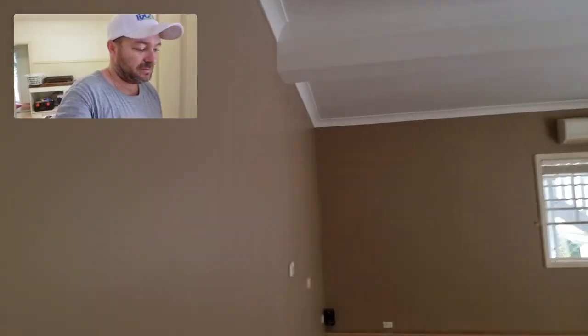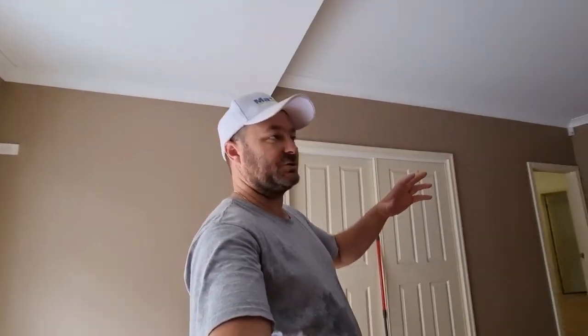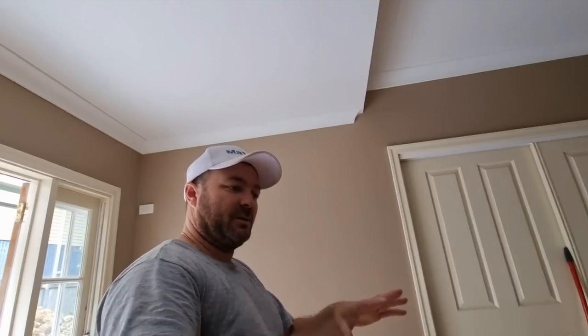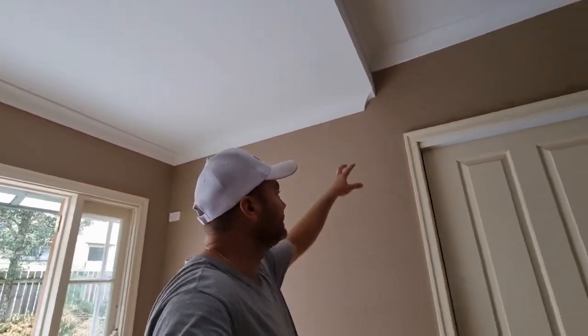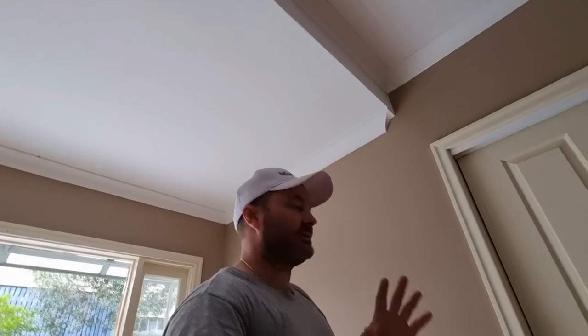The ceiling is just a little bit off-white — the ceiling is white. Thanks for watching this one. To summarize: that's how you fix a crack — use fiber fuse, use corner cement, make sure you screw or wing-nail and stitch it up. The rule is: do not use mesh tape, do not use fiberglass mesh tape — use fiber fuse. Make sure you hit the like button and subscribe. See you later.